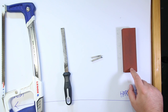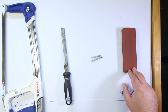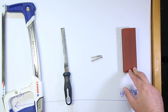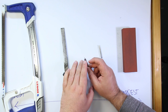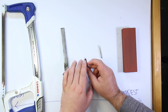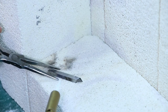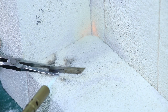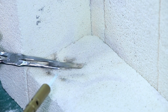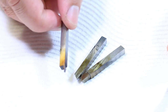The stone is the hardest of them all, but if I were to drop it off the bench it will likely smash into several pieces. This is because the harder a material, the more brittle it is. Currently these tools are too hard and with the working forces, the fine cutting edge and tip are likely to be chipped off in the lathe. Some people figured out that by reheating hardened steel and letting it cool down, it will soften the steel — and the amount of heat applied relates to how soft the steel will get.